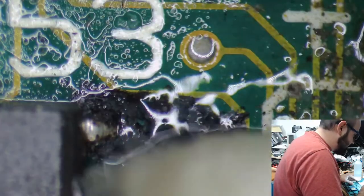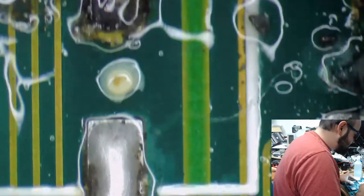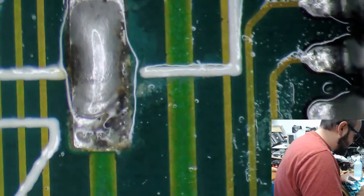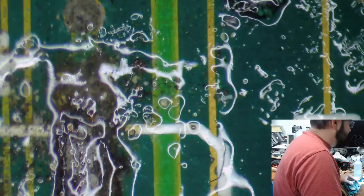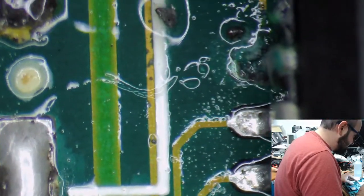So what is leaking is the electrolytic juices that are in the capacitors to make them work. After 20 to 30 years, the way these capacitors are storing that liquid, which is highly corrosive, they just tend to leak. And there's a pad there, but it'll turn a pad like that into that. Okay, horrible. And there's green on these chips.